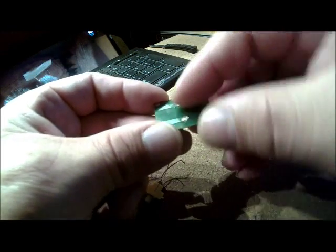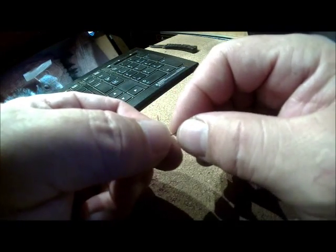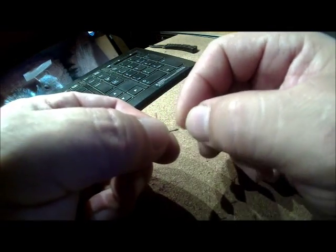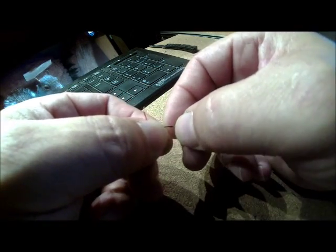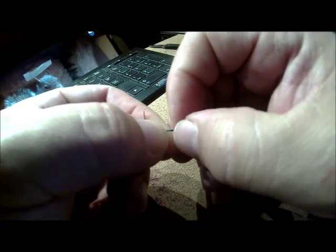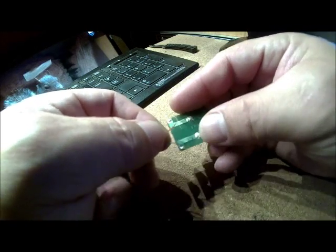Those are cleaned off — that's simple, just use your nails. These wires are so thin it's ridiculous. I already did one. What we need to do is take the insulation off the other end. Just use your nail, go up about an eighth of an inch and pull it off using both nails if needed. Get all of that off because we need to tin those wires, just like I did in another video.